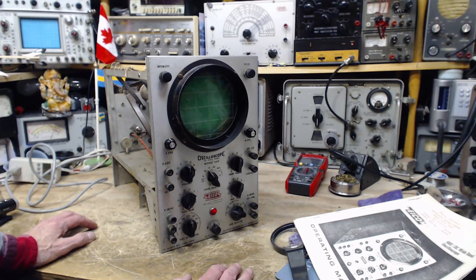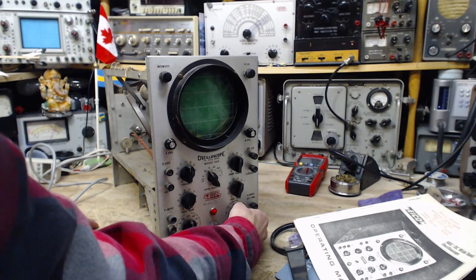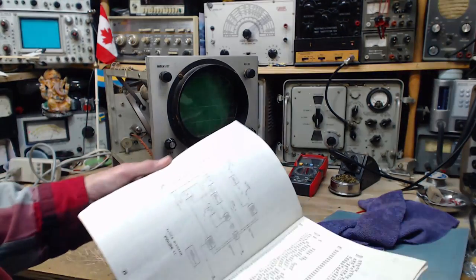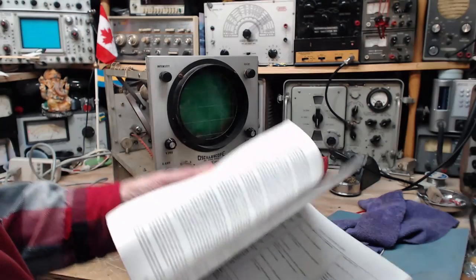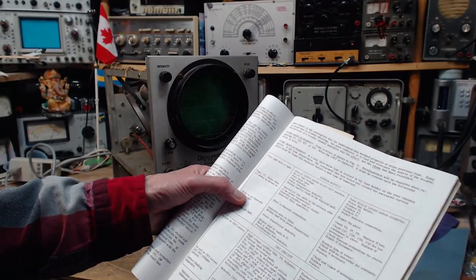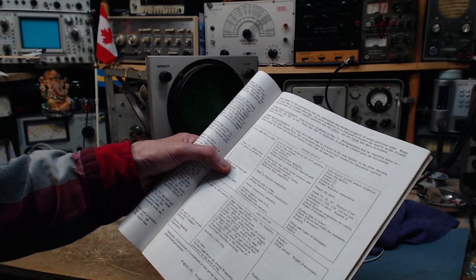Any other controls that might be upsetting things? We should flip the sync around a little bit. There isn't even a flash going across — not even a single sweep. I have some high voltage voltmeters just itching for a chance to be used. Oh look — there's a whole troubleshooting guide in here: 'No spot on CRT screen.' Let's read this.